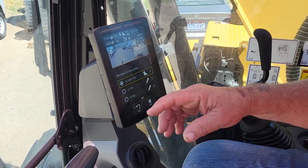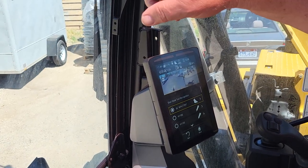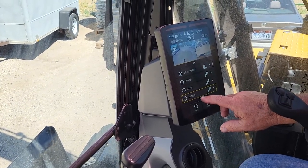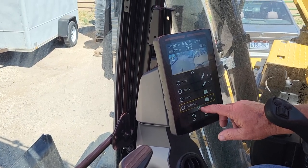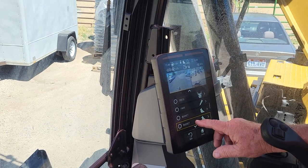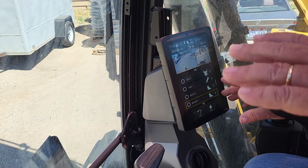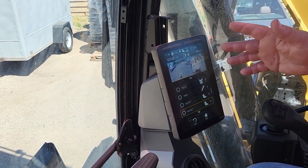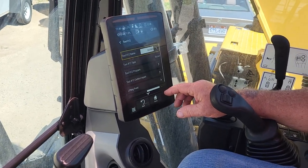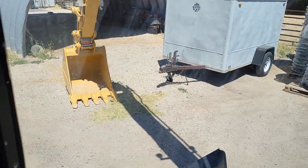This is to calibrate a bucket. You've got your 36-inch bucket on it. If I scroll down, maybe I put a 110 hammer on it — you've got auxiliary hydraulics already. You just go to whatever work tool and tap on it. This has got compaction plates, even a shear. You're going to find more empty bucket slots on here too. As long as it's a stock bucket, everything's going to work — other than a bigger bucket's going to weigh more, which will throw your scales off.